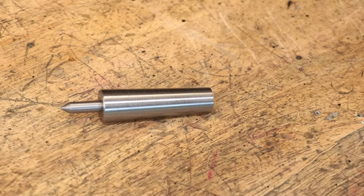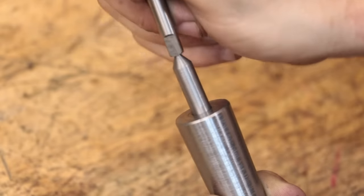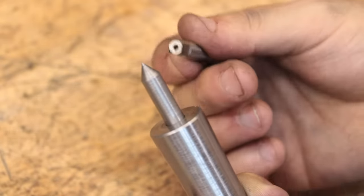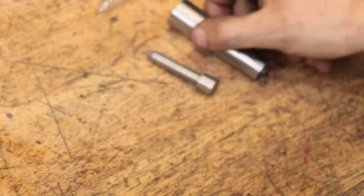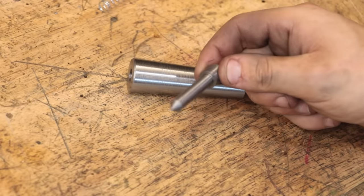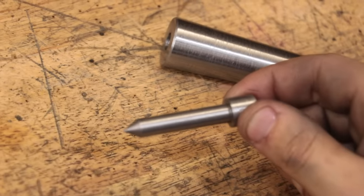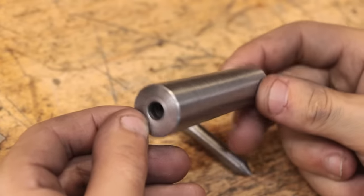This is a more conventional tap follower that I machined up, and for what it's worth, it's actually a pretty good piece of kit — it should follow taps as good as any other tap follower. It is a little smaller than the design I intend to make; this one is only a number two Morse taper. At least from a design standpoint, I think it's a little more complicated than it needs to be. The internals work by using a stepped cylinder design, and the step simply prevents the spring tension from pushing the center through the end, with a matching profile inside the main body.